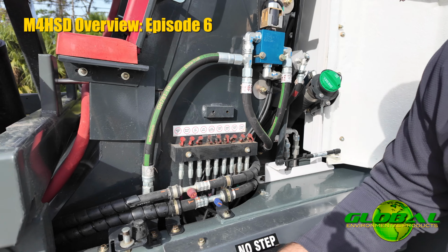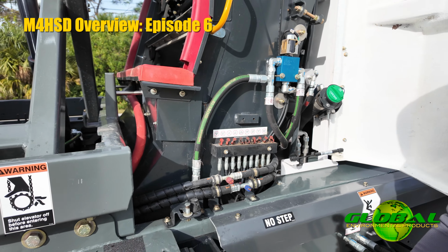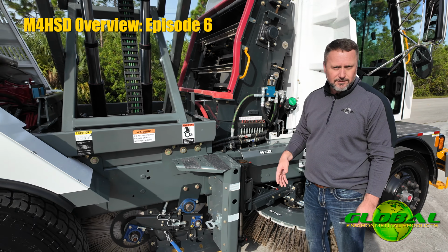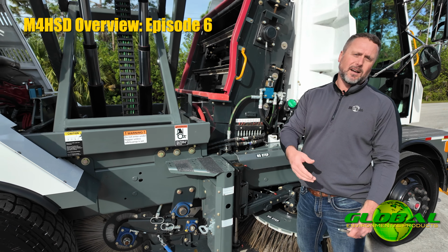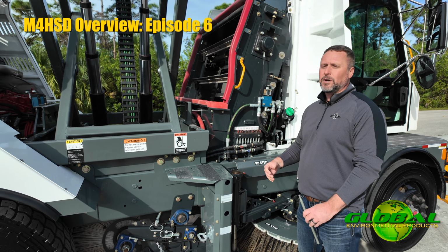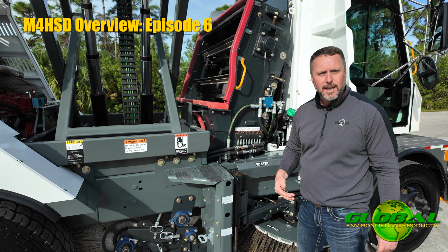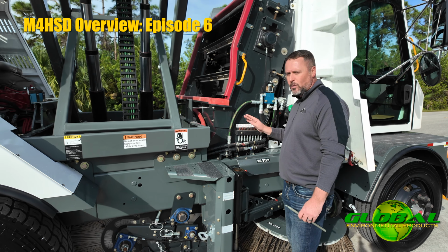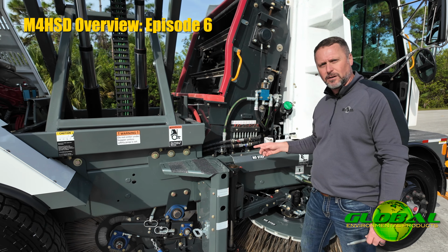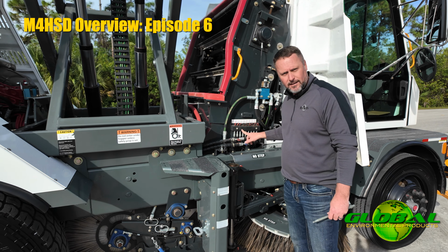One option that Global offers is auto lube systems, but I think we all realize that if auto lube systems aren't checked out as they're supposed to be, as recommended by the manufacturer in the book, you don't realize that something has failed until it's too late. With this design, Global ultimately has 9 daily grease points, and we run all 9 of those daily grease points to a single block, okay?